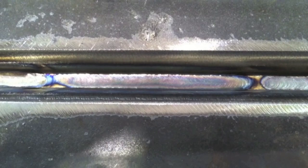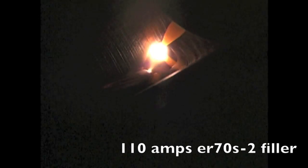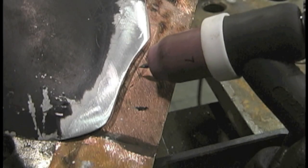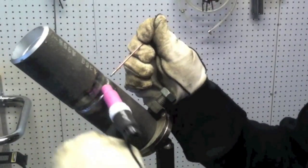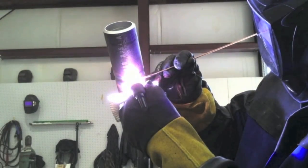Lots of tips, lots of instruction. Here's the second pass on that same plate test — settings on a plate test will work well on pipe also, by the way. Also included from 2012 is a repair on an aluminum boat prop, showing how to cut off the damaged section and TIG weld bead after bead to replace the metal, then blend and smooth it down to make it good as new using copper for backing. I also did a 6G series to help students prepare for a 6G test — I remember what that's like, the nerves. I showed walk-in-the-cup as well as freehand techniques for root and hot pass on TIG, followed up with stick.